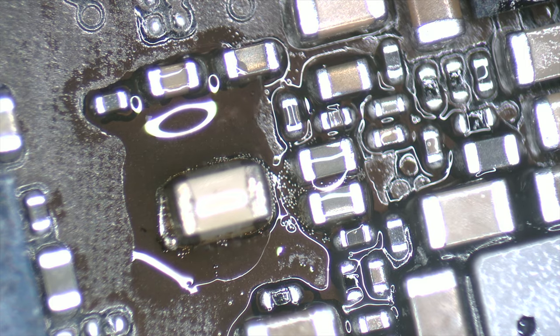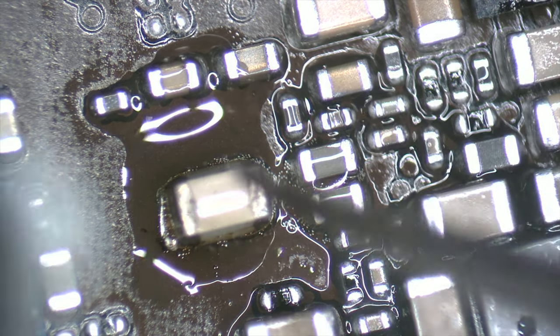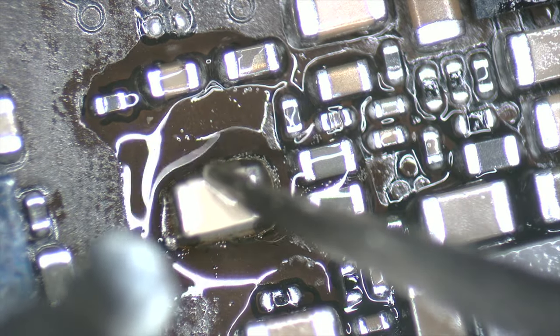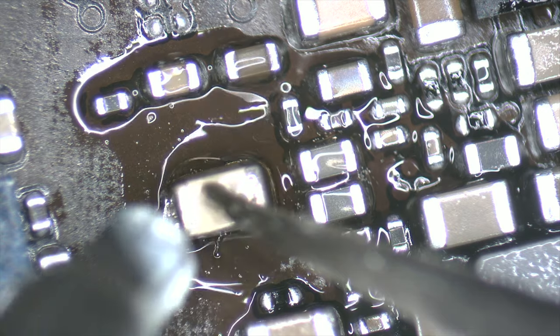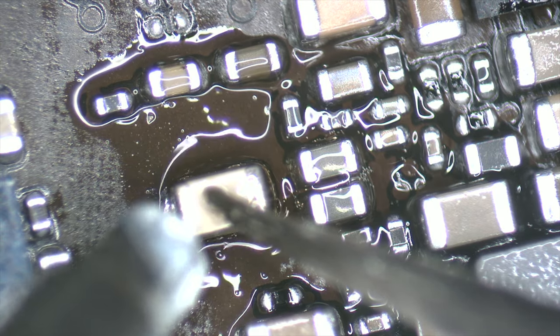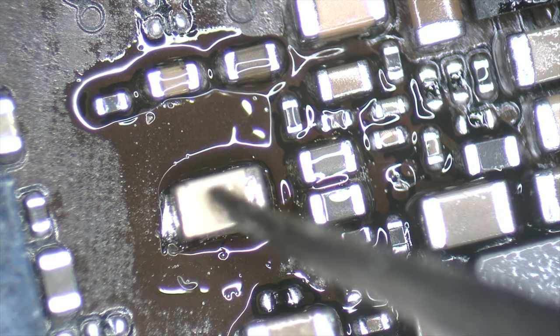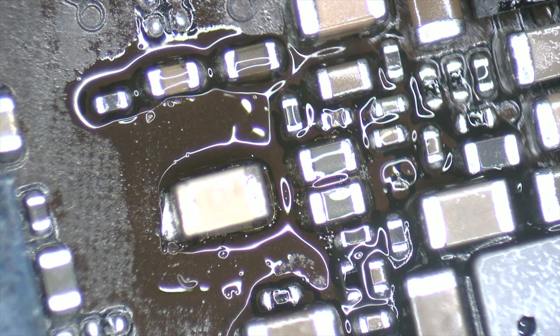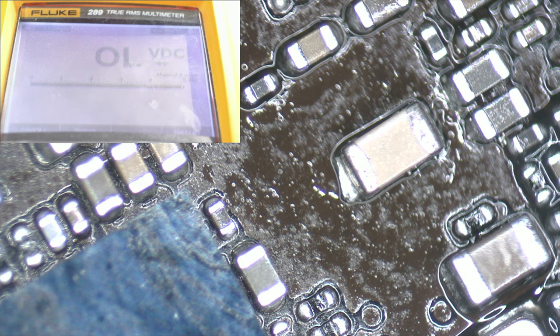Since it has not been completely soldered, I will increase the airflow from 10% to 20% to have a little more constant heat at the base of the component. Now, yes, the solder melts correctly and the component has been soldered perfectly. It's essential to remember that in life and also in micro soldering, everything is based on trial and error.